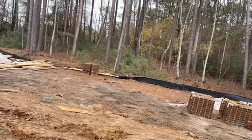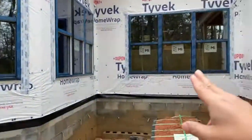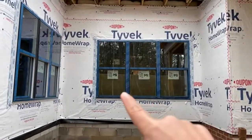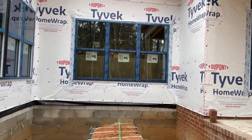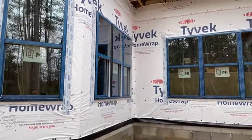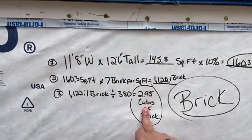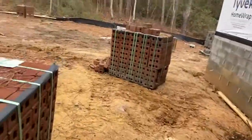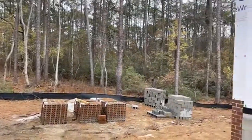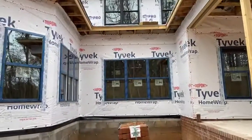When we count the cubes of brick we have on site, we have 45 cubes, so it looks like we may need an additional five cubes. But hold on — we do our math without subtracting the square footage of the openings on any wall. So looking at this wall, it says we need 2.95 cubes of brick, but we figured the whole wall area and didn't take out the area for the windows.